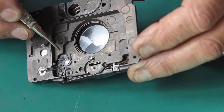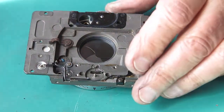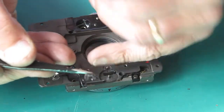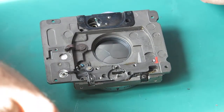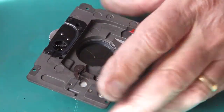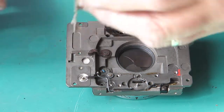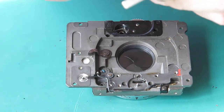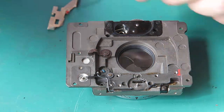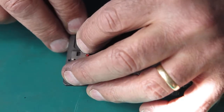I've got a piece of heat shrink on here. I've done up the four screws here to hold the shutter and focus mount to the front of the panel. This insulating washer here — the original looked like this. It was broken away on one side. I can only presume that was to provide some clearance around that piece of insulation that had been pushed on as an afterthought there. That's a bit unusual. The shutter release lever here I'm going to fit in place. I'll just rub a little bit of molybdenum paste very lightly on that front surface. Its return spring sits right here and has to be caught under that tab, otherwise it won't work. So I'm going to get that positioned correctly.